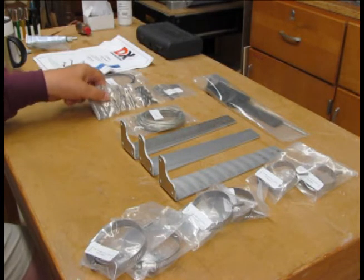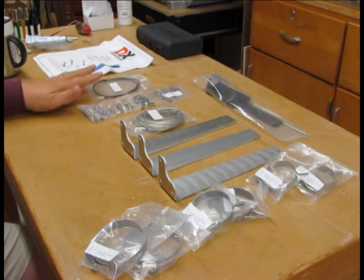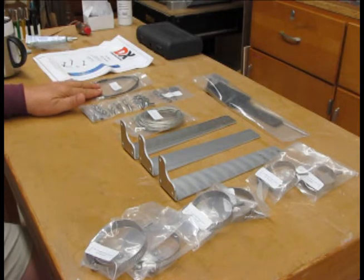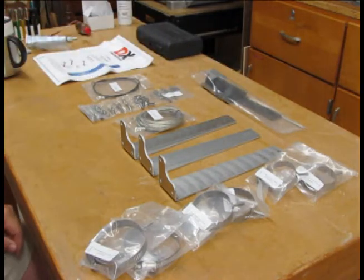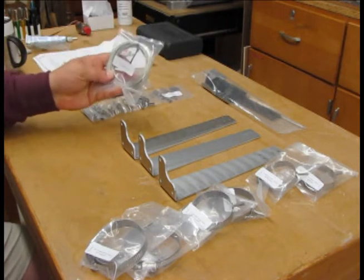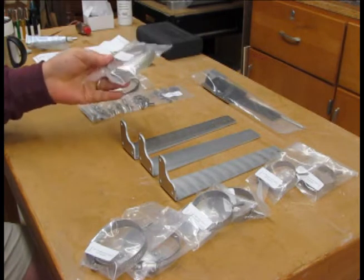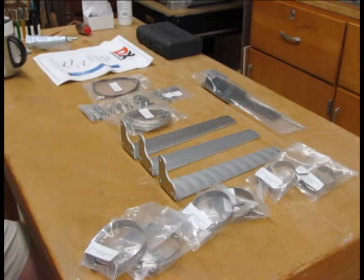The hardware for the various pieces is already sorted out. Here's a wire that goes to the feed point, and then some plastic insulators and also a little matching network for the top — that's pretty much the entire kit. The element itself is a piece of flex weave wire that's tinned and has lugs on the ends to attach to the various standoff items, and that will be the entire antenna that will stand off to the side of the primary vertical tube of the 8040 VA.